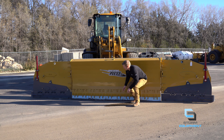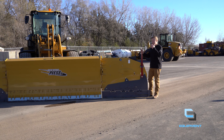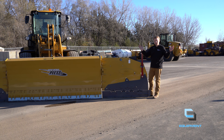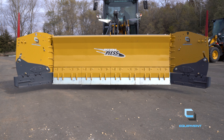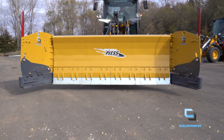Let's take a look at the wings. On the Max Pro 10-48-22, you have independent wing function — the left wing, the mold board, and the right wing move independently of each other. So you can have this in a soft angled pusher, you can have it as a 22-foot wind rower back dragger, or you can have the wings move all the way back into tight sections of your accounts, giving you that up-tight back drag in loading docks or between two obstacles.